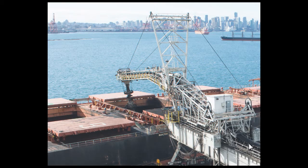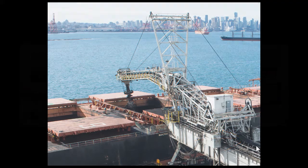There are occasions when the shiploader cannot be unplugged just by using the water sprays and must be brought to the dock. Laborers will wash it once it gets to the dock. If the shiploader must come out of the hatch after a plug-up, be sure that the conveyor belts have been run dry first. When there is cargo on the conveyors and they are not running, never shuttle in. Damage will occur to the shiploaders.